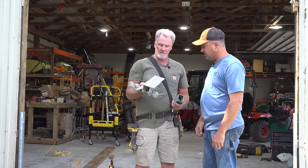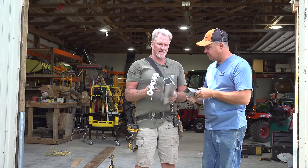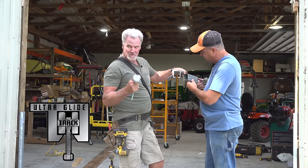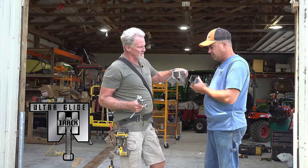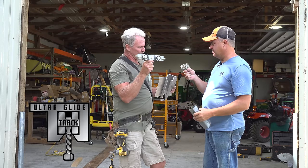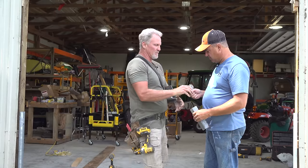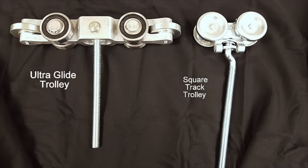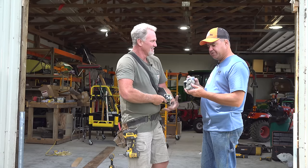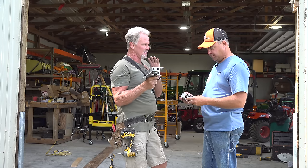This is the track that comes with this I-beam door — and that's my old track. You can see a difference: this is an aluminum extruded track patented by I-beam Doors. And this is their patented trolley — a 3,000-pound trolley, aluminum extruded track with sealed bearings. This is your typical pole barn trolley — a 150-pound trolley on a typical track. So this one is rated for 150 pounds and that one is 3,000 pounds — a lot heavier built.